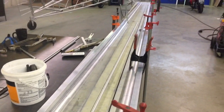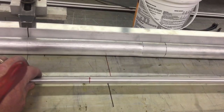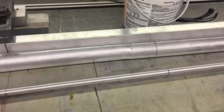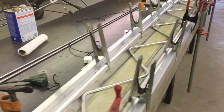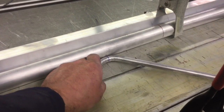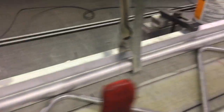There's what it looks like with both the top and the bottom of the spar in the fixture. I just clamp them in place, and this half-inch tube gets bent and it just zigzags from top to bottom — it gets bent every 11 inches. I've already got all that pre-marked. I've got it all bent and it's just roughly fit in there to give you an idea of what it's going to look like. It gets welded at every one of these joints, but I want it centered on this tube, so I'll have a little shim underneath there to keep everything right in the center.